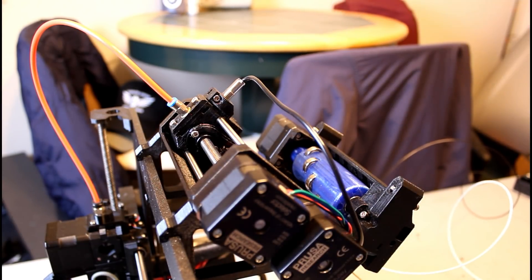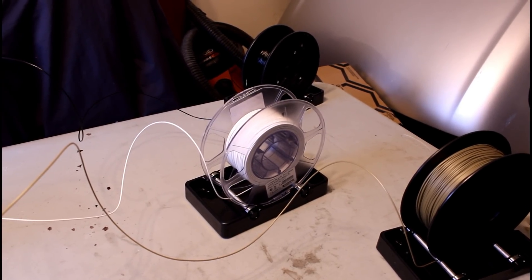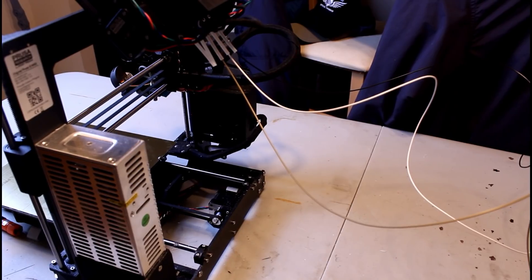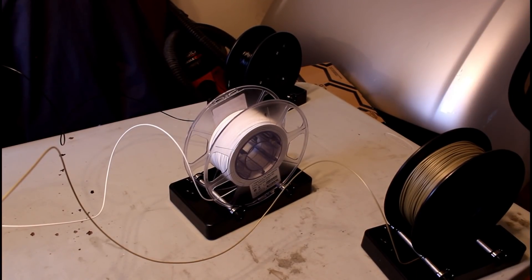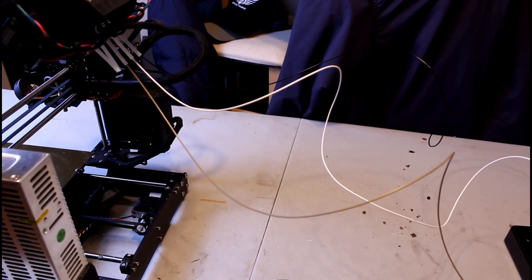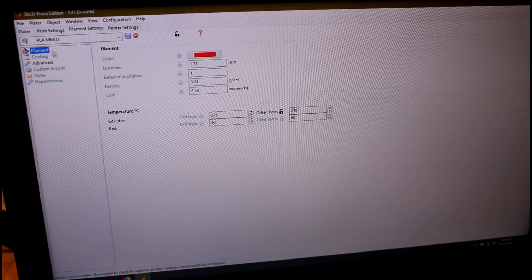I was starting to get stripped filament on the first couple of positions, and it was all because this thing was getting melty and soft. So I printed a new one in polycarbonate, and as you can see, it seems to have worked. Then finally on the hardware side, I got rid of the funky take-up mechanism for the spool holders and I'm just letting the filament free-flow into the tubes. I have shortened tubes now. They didn't cause a problem before but they did eventually, so I took those off to eliminate friction and knotting. It ran smooth for 10 hours.